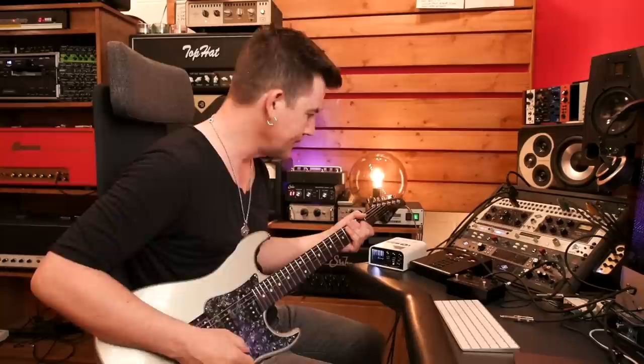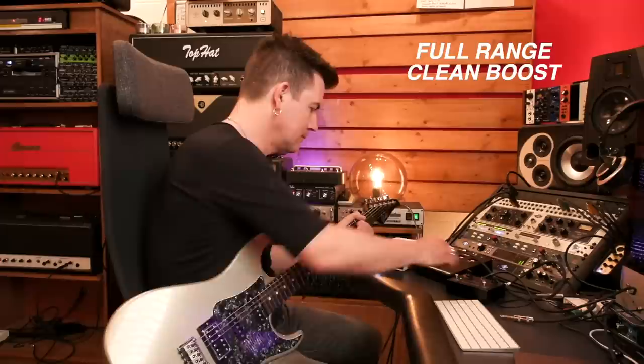On the left side it's a clean boost, full-range, like a CRAMP style. On the right side you get a targeted mid-range boost — you can adjust how much boost is happening with the knob, it's interactive with the other boost knob, and you can pick the frequency with the switch. It keeps the amp tight too — I'll show you the clean boost first, then the mid boost, so you can hear how it stays tighter and focuses the mids.